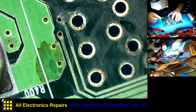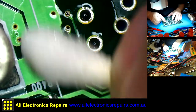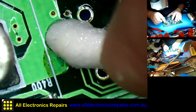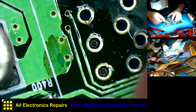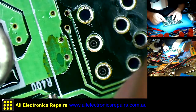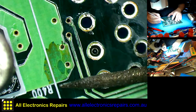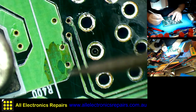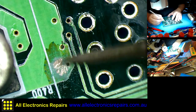I will be cleaning it several times still. You see this discoloration here. What I mean is the dark green, not the brownish color, which when I rub it keeps on coming off here and there. What I mean is just this dark discoloration. What it means, and those here, is that there is corrosion under the green paint. And if that corrosion is not removed, it will keep on spreading. You can see how easily that paint flakes off.